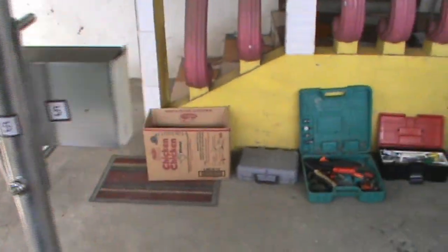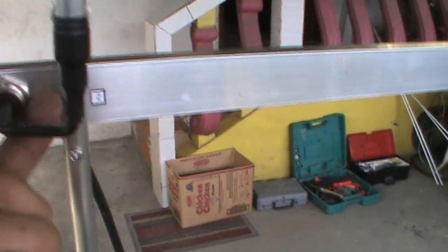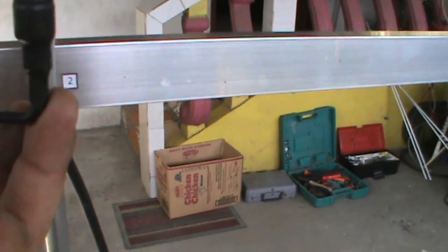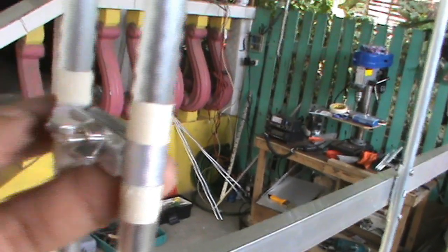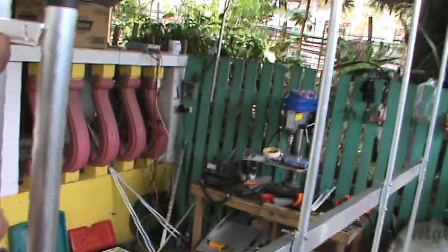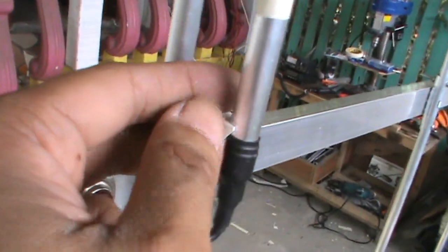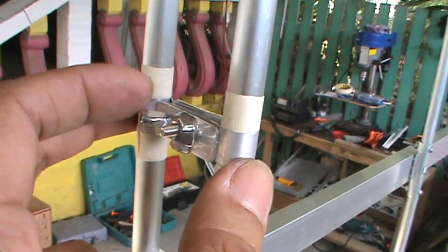First let's quickly check the antenna pinpoint. The elements are marked, so just put back those elements according to the numbering and the orientation of the numbers. Make sure that you tighten the nut on the SO-239 connector attached with the gamma match. To tune the antenna, just put back the tuning stub in between those marking tapes. These two are plastic spacers — secure them with a cable tie to make the gamma match more stable once installed on your mast.